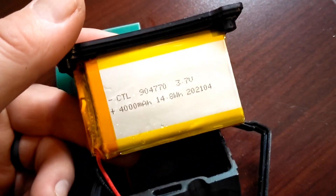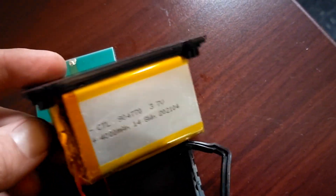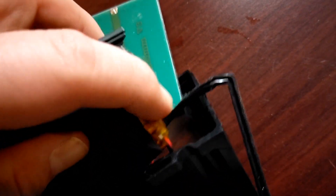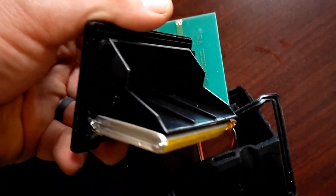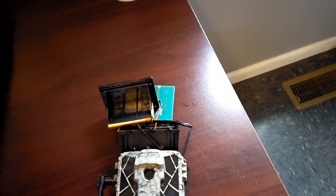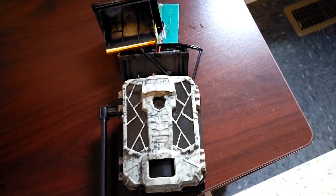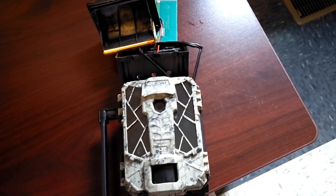The little 4000 mAh battery is just wet as can be. I've already been playing with it trying to get this to shoot just right. There are moisture droplets inside this yellow film that keeps this isolated. What that does is, with water droplets in there, it short circuits the little lithium-ion battery and tells the camera that it is completely dead, and then it just sits in there. You bring it inside, you mess with it, and if it dries back out, it takes off working great.